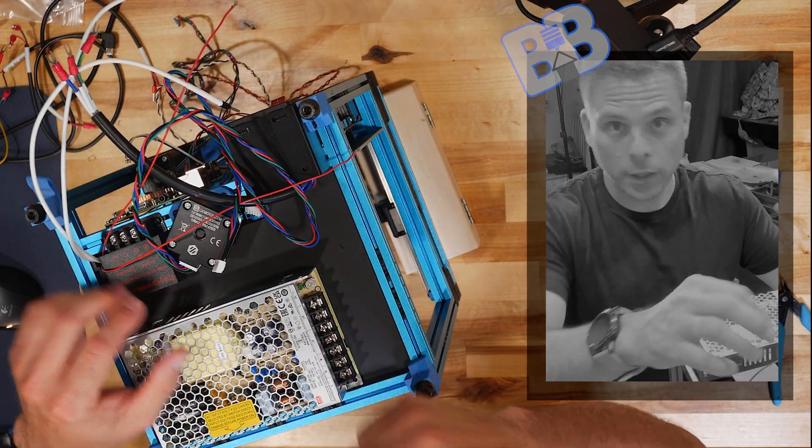On the printer we have our L, our N, and this funky-looking ground symbol — a line with a bar and then some small lines pointing downward into the ground. Over here we have our voltage minus and our voltage plus. In DC you have a negative and a positive — if you hook them up backwards it will be a negative voltage. You don't want to do that. There's also an LED indicator that everything's powered on, and an adjustment screw to adjust the output voltage.